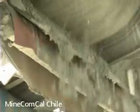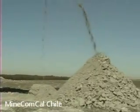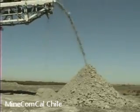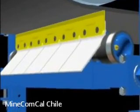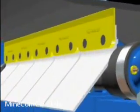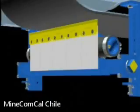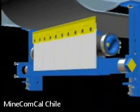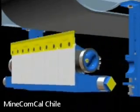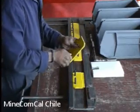No skilled labor is needed to keep the dirt whacker functioning optimally. Only the air bladder pressure needs to be maintained as determined during the initial commissioning of the dirt whacker cleaner. Blade height must be verified at regular intervals. The abrasiveness of the bulk material will determine this interval. Replacing the blades is a cost-effective operation of removing the unit by undoing 4 bolts. By making use of the blade alignment tool, the blades are aligned with ease.